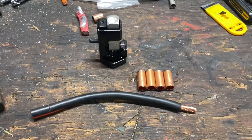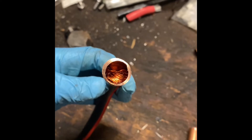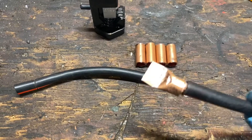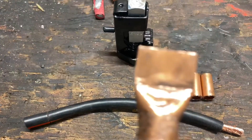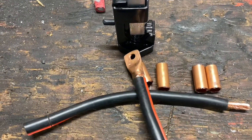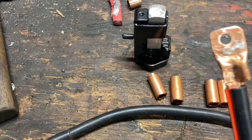Just making my own copper connections - making these fit here. So just beating it onto one end. You can see right there it's actually got the copper strands above the pinch, which is good, so it's not coming out. Now I'll just flatten down the end. I've not drilled the hole in them yet, but using the punch rather than the soldered method with this tool here - seems to be doing an okay job. Then I've got to put some heat shrink on, which I've run out of. I drilled one already just to see what it would look like. This is a prototype - slightly a bit big with this half-inch copper pipe, but it's working out so far.